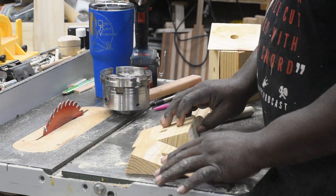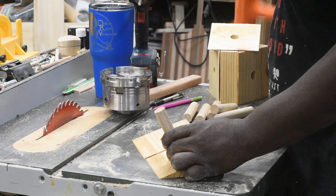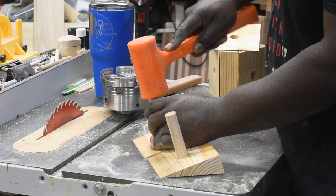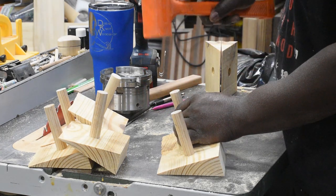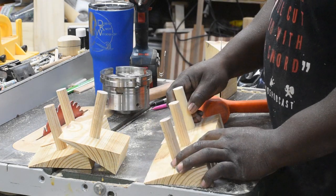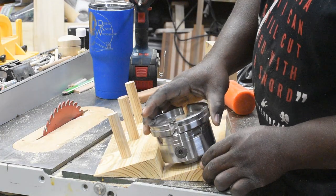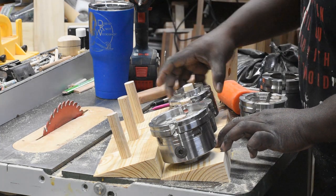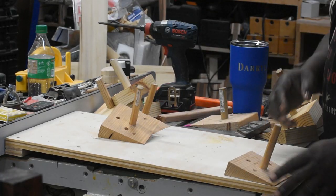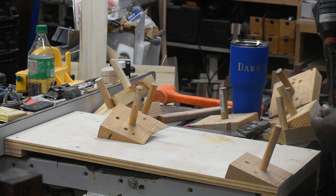Now we're on to the exciting part — making this thing work. I cut the block in half, separate them, rotate one around, and I'm able to get two blocks that have the hole at the right angle facing up to make sure the chucks don't fall off. I just take a dead blow hammer and drive the dowel down in there. Once you get this far, you can configure these blocks on a substrate such as a piece of plywood or solid wood. I hang mine on the wall with a French cleat, but you could easily attach this directly to the wall or any other method you have.